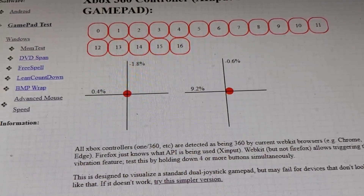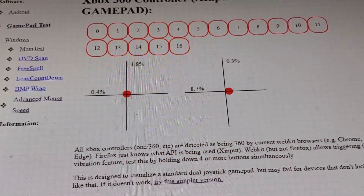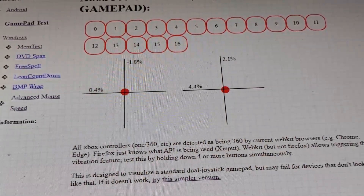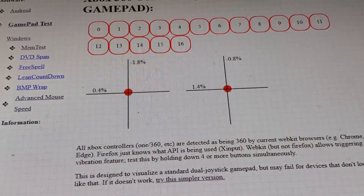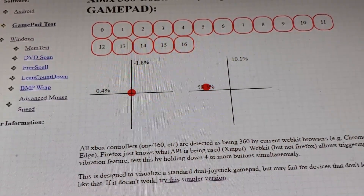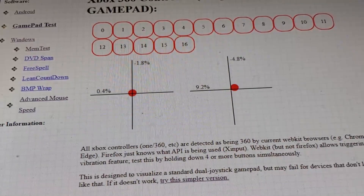So you sort of have to choose your poison — you get to be as close to neutral as possible. If you use it in normal everyday use where you let go of the joystick, once you've pushed it to its full range, you can see that it does a pretty good job of centering itself. And if you look carefully, you'll see that it's smooth and continuous over the whole range, even though I've added those resistors.